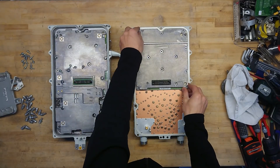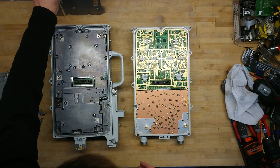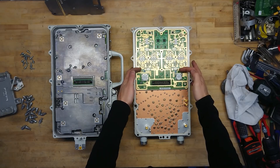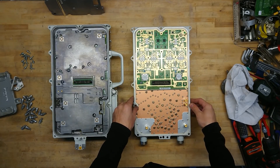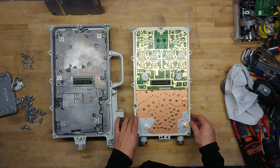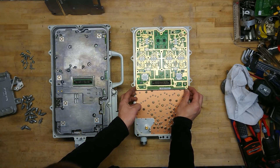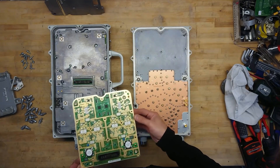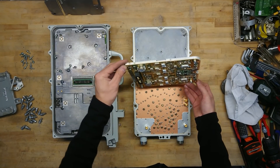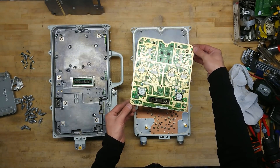Let's take a look at the power amplifier. This actually seems to be completely mirrored down the middle — two channels. There's a small difference with a 50-ohm resistor, but otherwise this looks like a really great layout. It's just one big heatsink that the whole PCB sits on. It's glued with a heat-transfer compound, and you have all the power transistors sitting directly mounted onto the plate.